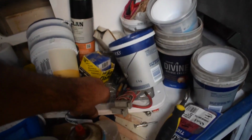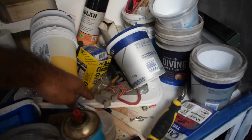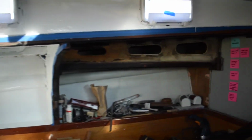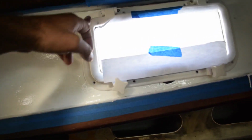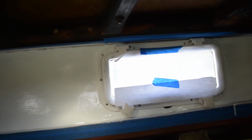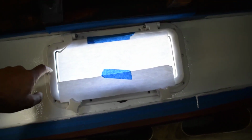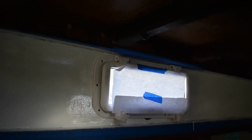we've got the external face plates, these things, which will need to go on. But I always leave it a day or two, because if I see after it's dried, if there's any gaps on the outside between the coach roof side and the actual porthole, I can squeeze a little bit more Sikaflex in. So before I seal it completely, I want to make sure that it's sealed completely. All right, what next?